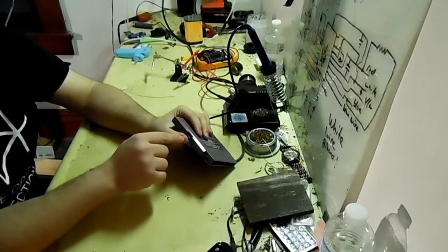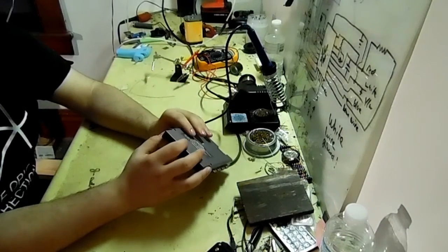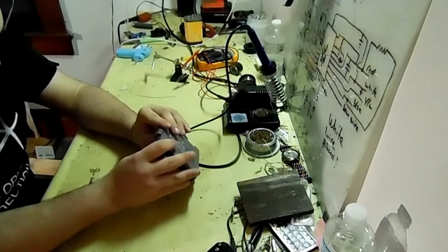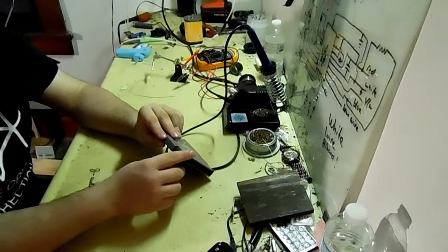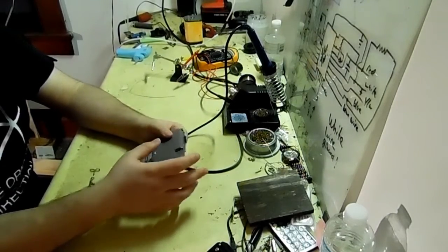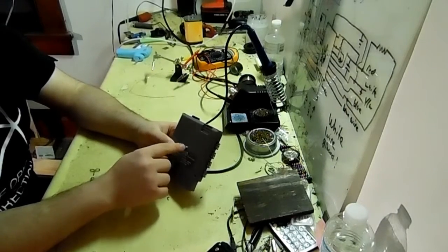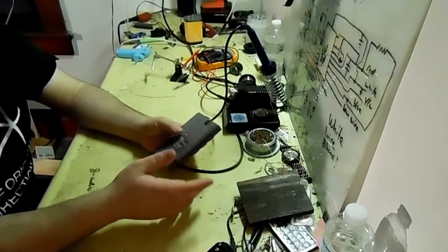On the side you'll notice the HDMI output. Playing old school games is really cool on an HDTV, and I had to have HD output because I couldn't settle for the analog output the Raspberry Pi offers — plus audio is taken care of on the HDMI as well. Right below that is a mini USB for power input. I used a mini USB because I have a mini USB breakout board that was a lot easier to solder to, so I just jumped the Raspberry Pi's positive and negative to it. And right in the middle where there should be a screw, there is a little on/off switch to turn off the Pi after a terminal shutdown, so it's not drawing power or generating heat.